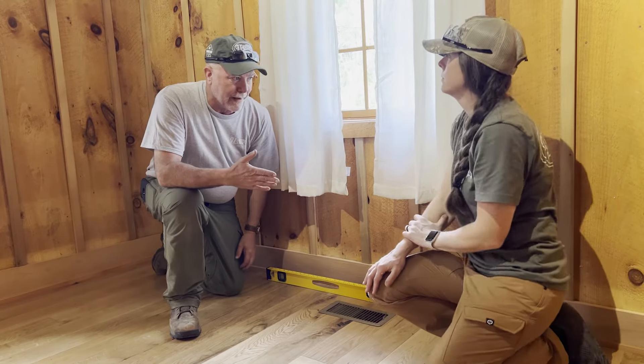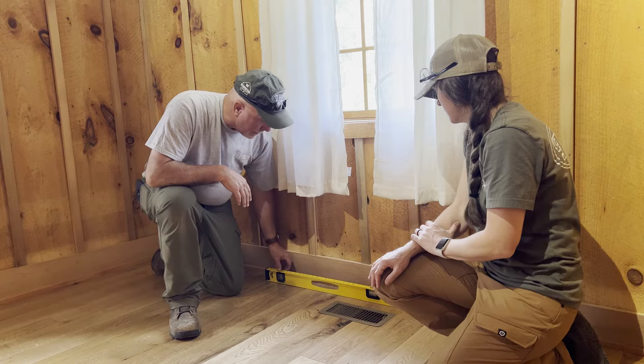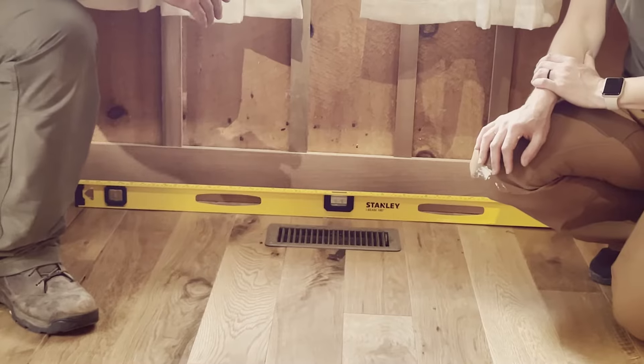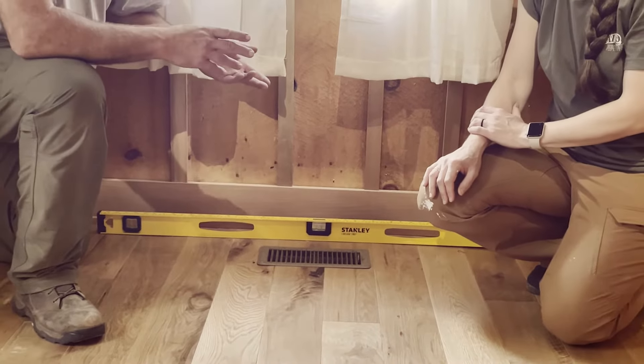This room, if I remember, is about 11 feet across the front wall. But in a four-foot area, we have a quarter to five-eighths of an inch variation. And when we were doing this baseboard, that's when it becomes an issue — how do you handle it?